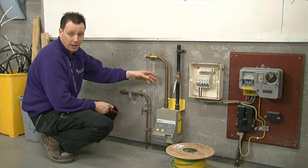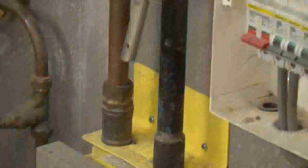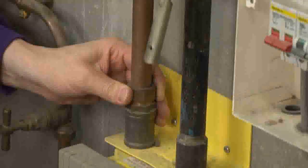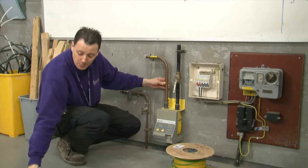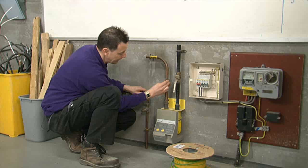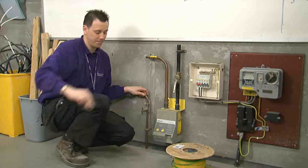We're going to stop there and move on to the next part. We have the gas pipe coming in and the main control valve here, going through to the gas meter and then into your house. Remember what the on-site guide tells us: it must always be after the stopcock and before the T-junction. We have the copper pipe, which means we use the steel wire wool to clean up that pipe, removing the dirt, grease, and grime so we get a really good connection on there.